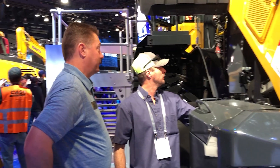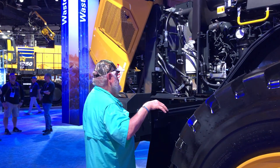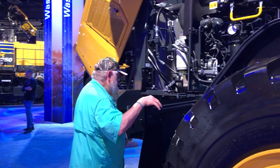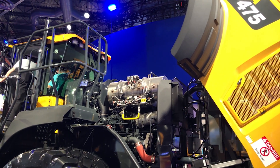There's a switch that opens the rear hood — that's a new feature for us. Typically you won't be opening the hood very much unless you're doing PM services, servicing the DPF, or some of those other things. All the daily checks can be done from the side doors on the side of the machine. The rear door opens up and the fan swings out to show the side-by-side coolers we have on the machine.